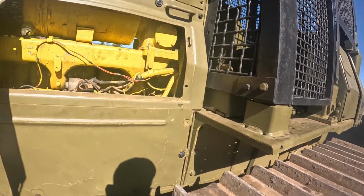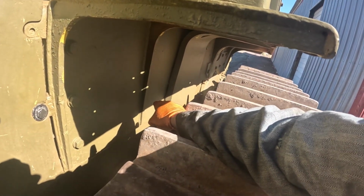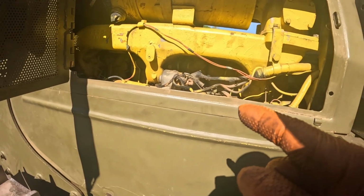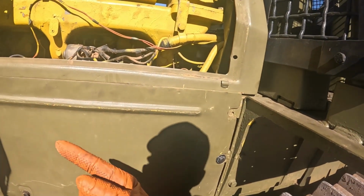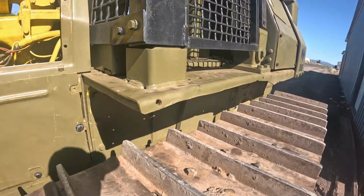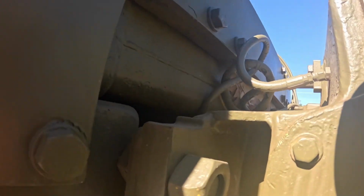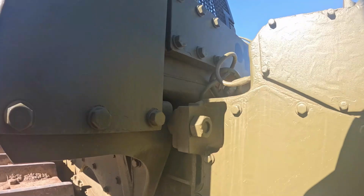And so what they did is they got this tank down here. It's inside. We got to pull the deck plate out. But they've got the return line coming off the PT pump and the supply line on this side of the tank going to the pump, right? So the return line goes into the top, the supply line comes out of the bottom. There's a float in that tank. Okay, so back here there's a ball valve on the main tank right here somewhere. I just had a hold of it. Where in the hell? It's back up in there somewhere.